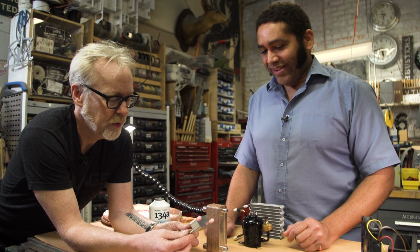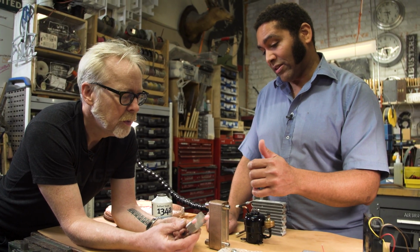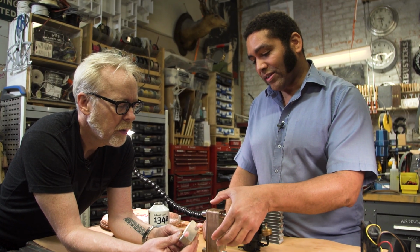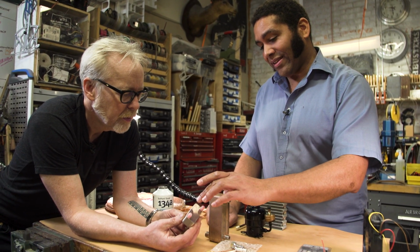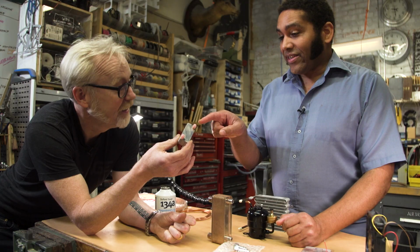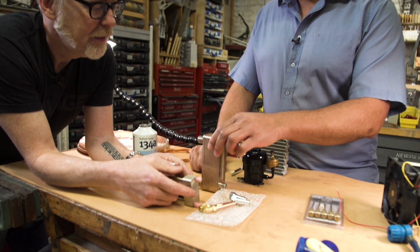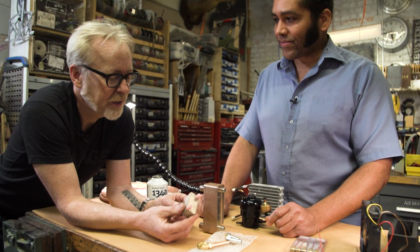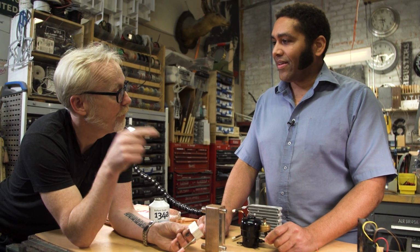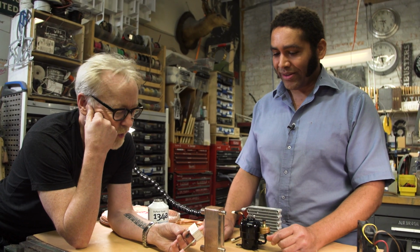Good God, wow. So we can etch microchannels in using photolithography processes that are super precise. We get a much smaller, more compact unit that doesn't quite have the capacity of this, but you can see that's an impressively small thing as a heat exchanger for something that can cool down a human body. This is rated at 800 watts of cooling. That's unbelievable. This is rated about 1.2 kilowatts of cooling. And this is so efficient because you can get high amounts of precision in the etching process, and thus a lot of flow through it, even though it's really tiny. A lot of flow and a lot of surface area for exchange. Right. So surface area is everything.